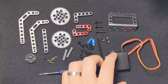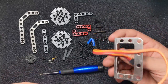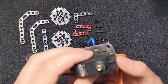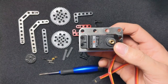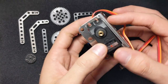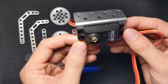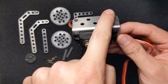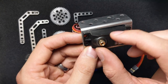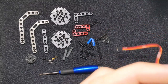The first thing we're going to do is mount our servo inside of the servo bracket, so let's go ahead and put it in wire first. Orientation matters a lot here. If you face the side with all these holes out away from you, the spline of the servo should be to the right. So we're going to flip that around.